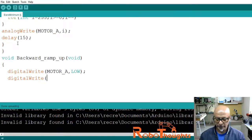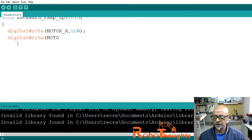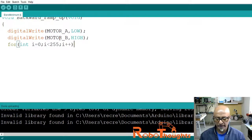digitalWrite, let me just scroll it up so that you guys can see, motor_B, HIGH. All right, and then we will take it into the loop of for (int i = 0;, then if i is less than 255, we need to increment, i plus plus, like this. Okay, and then we will open another block of code with a curly bracket,